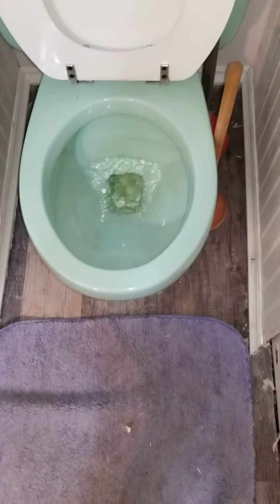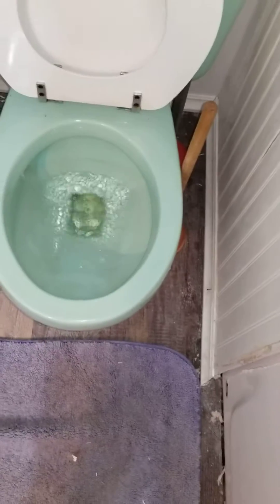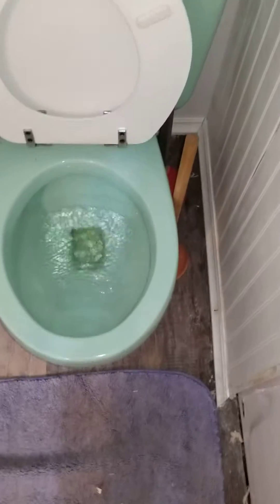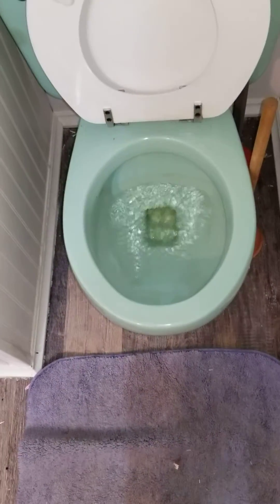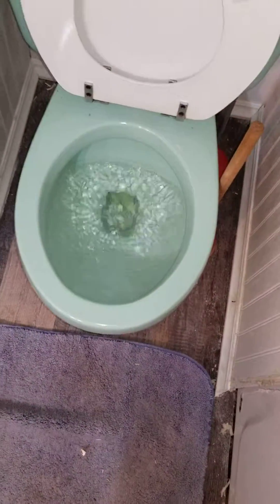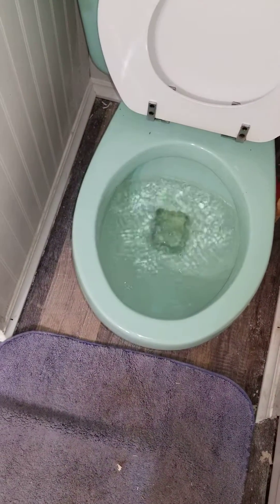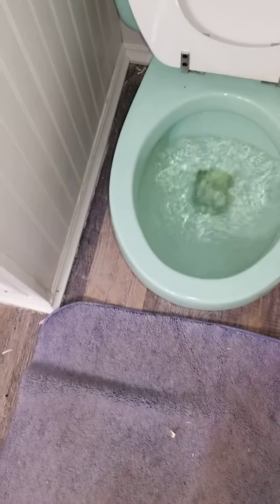Modern toilets do the exact same thing. The only way a modern toilet is going to be effective is if the flush continues after the siphon. So it needs to siphon within the first one second of the flush. I mean, it didn't do terrible to be honest — it did okay, but there's still dye left in the bowl. So I'd give that like a 60, 65, maybe 70%. So it removes about 70% of liquid waste with 1.6 gallons.